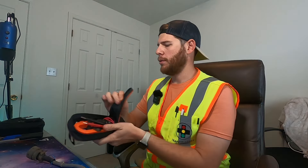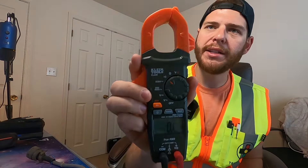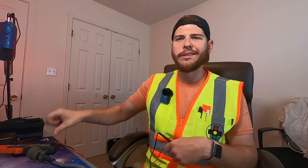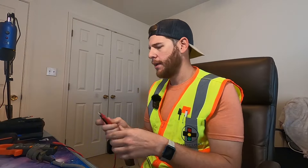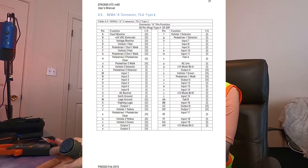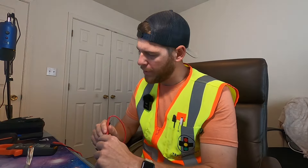Let's go ahead and get our Klein meter out of the bag and set it up to continuity. Once you have it set to continuity, make sure your leads are hooked up good - touch your two leads together and you can hear the ringing; it means it's checking for continuity. Now we can look up our pin connector layout diagram. We need to find the earth ground, the AC neutral, and the AC line. On this diagram, our neutral is labeled 'U' - and it's all labeled on these NEMA style connectors.